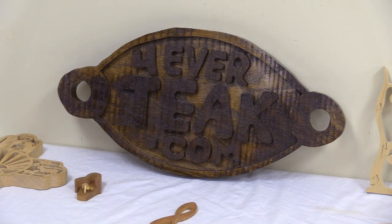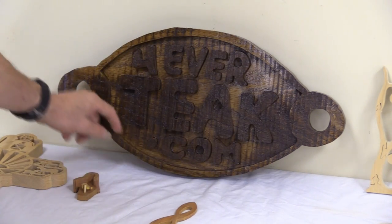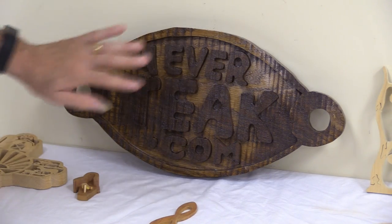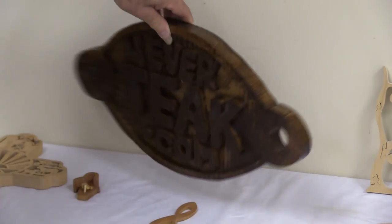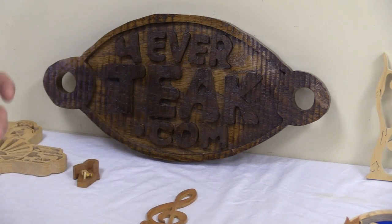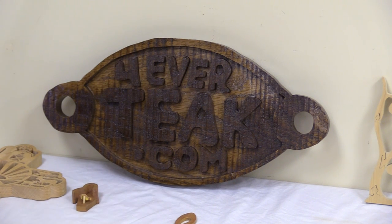put the letters on the side, and then I drilled a hole and cut that out, so now I had this piece that had all the letters in it. Now I could either sand it and make it less, because I'm flush on the backside, or I could use a router if I was Larry, but I would have to take 4 or 5 hours to make a jig to get it to do the router. But I just took it on the bandsaw and resawed about a half inch off of it, and then I put the letters back in to give it that recessed effect.